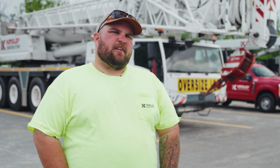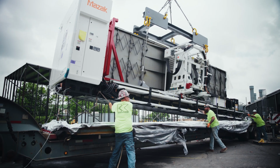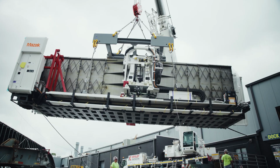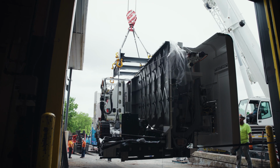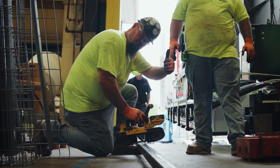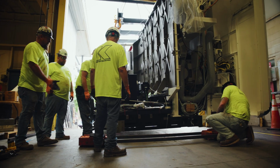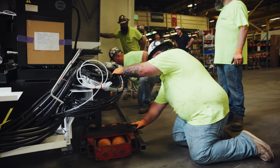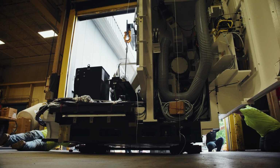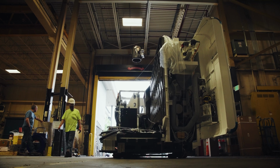So we put them around the lifting lugs, then put pressure on the machine itself to bring it off the trailer. Then we had to unbolt the machine from the frame, fly it over the door of the building, and then get the machine halfway in the building, sit it down on skates, then had our VersaLift from the outside. Once we picked it up with the VersaLift, let the crane down, put all the pressure onto the skates and the VersaLift forks, unrig the crane, then slowly fed it into the building with the VersaLift.